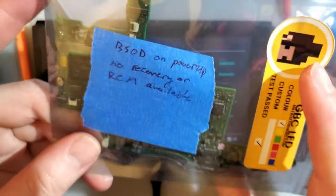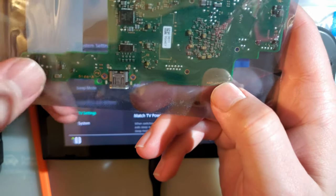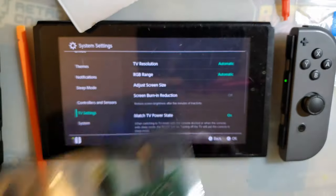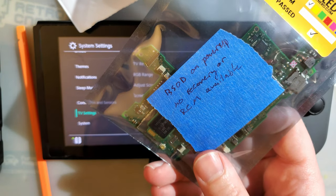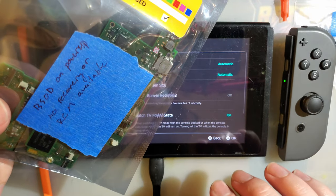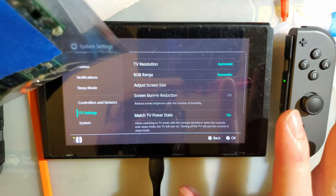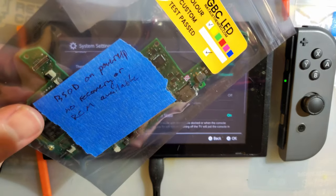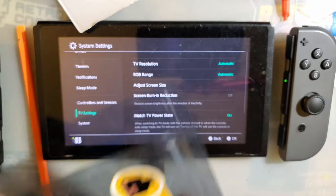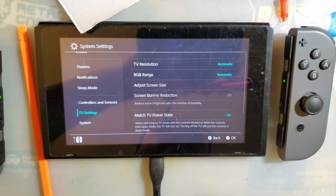I'm gonna do this one now. This is the Mariko one. I'm gonna do literally the exact same process, and hopefully it'll work, because this one has literally the exact same symptoms. Boots to a blue screen, boot it without the NAND, boots to a black screen, straight in RCM mode, no problems. And Bob Shanti. I'll make a note in the description if I'm successful.